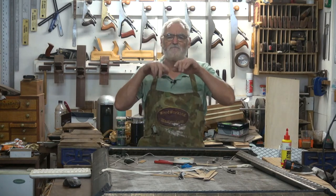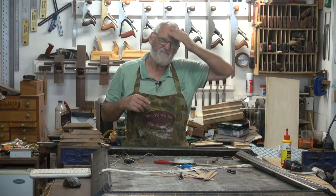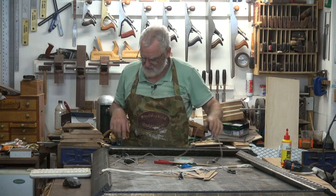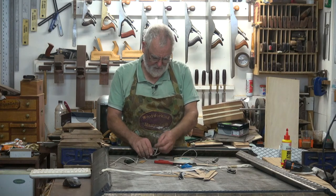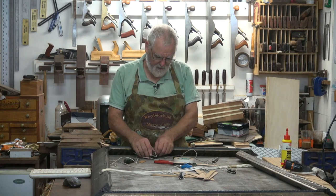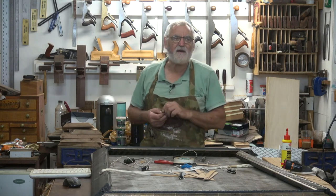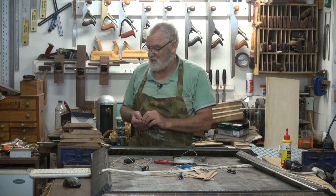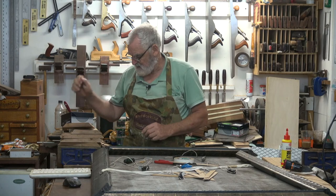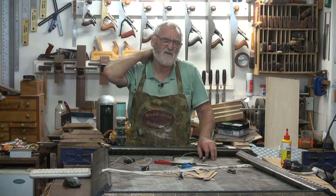My brand for the B-boxes. No, I'll braze it, so it'll be Oxy, because it's only a brass brand. I should actually get one made in steel because it's pretty hairy. I can heat it up to about 600. I'll go to 660, which is the melting point of aluminium. Brass is about 890, I think, and copper's just over 1200.